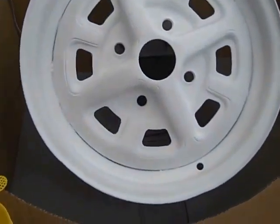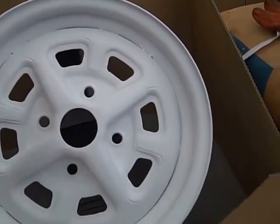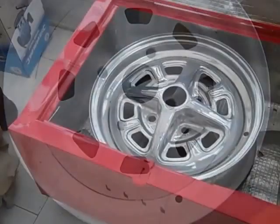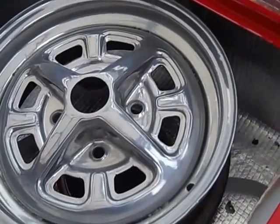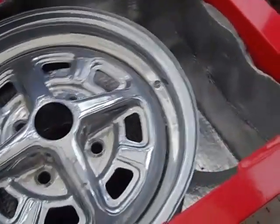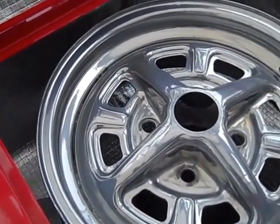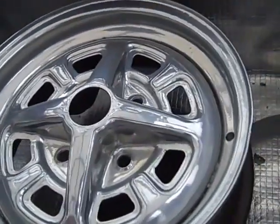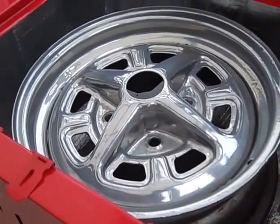That's now got the clear coat on it, and it's going in for the final cook. Hopefully it'll still be a nice chrome finish. This is the chrome wheel after the clear coat, and as you can see, quite a lot of the real sparkle of the chrome has been dulled down. However, without putting this clear coat on, I'm told that it will eventually dull down a lot more than this. So at least it's now in a state that it will remain as — it shouldn't dull down from this.